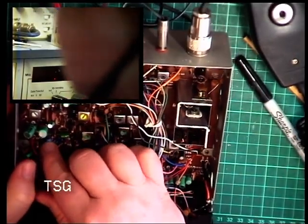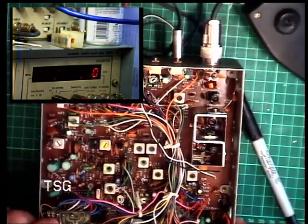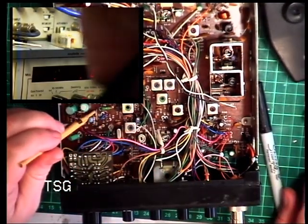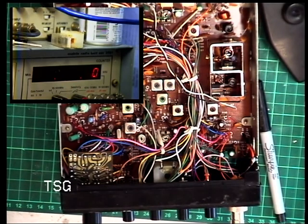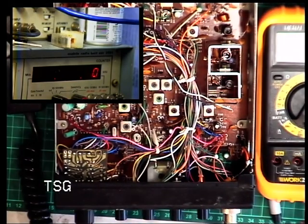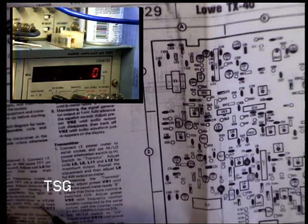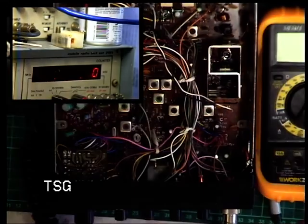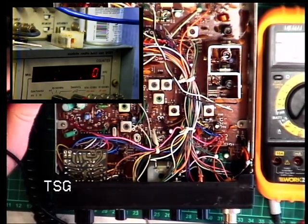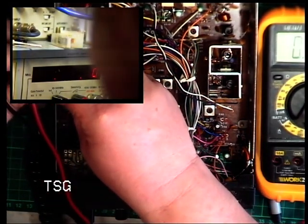Yes. So chances are it's going to be the green mylar capacitor there. It's going to be there, this is the test point. It'd be easier if they wrote these things down, wouldn't it? I think this is the VCO one. So, yes, it is. So, we're staying on channel 1, and so we need to be between test point 2 and earth, and we're looking for 2 volts. 2 volts with CT1. So earth, capacitor 6. I could put a crocodile clip on.